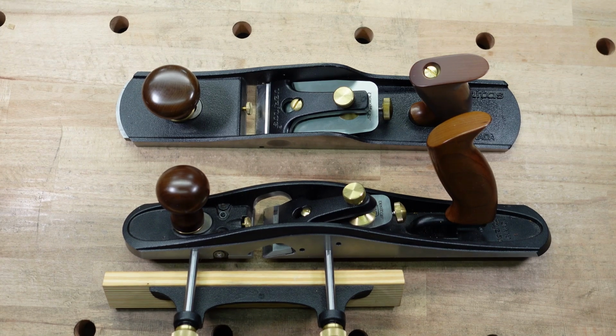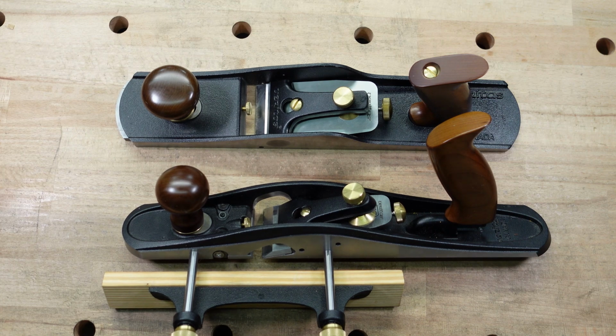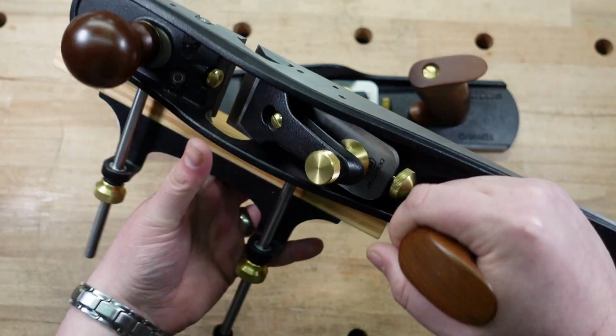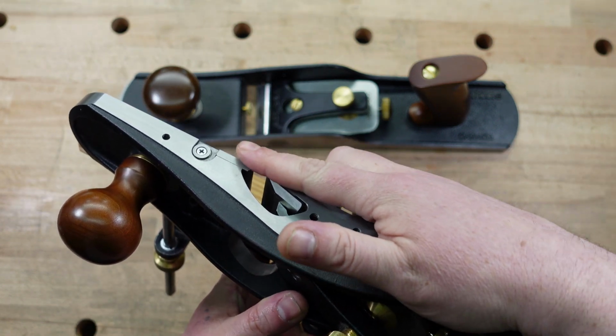Alright, so here they are side by side. You probably guessed, this is the Jack Rabbet plane and this is the Bevel Up Jack plane. So what does the rabbet part of Jack plane mean? That is this being open on the side, so you can cut into corners. It's probably better to show you on this side. So you can cut into the corners of cleaning shoulders, tenons.